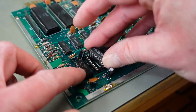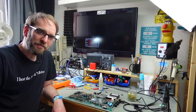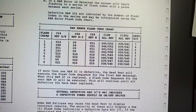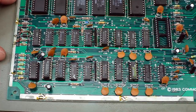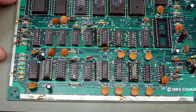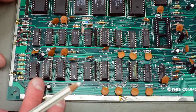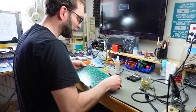I'm putting in a known good RAM chip - Texas Instruments. That definitely changed the behavior of the dead test - we now get four flashes, which means U23. I'll replace U23. As I said, I might as well replace all these RAM chips, but the dead test is a good way to do it - if your multiplexers are working correctly, you get a pretty clear indication of which RAM chip is at fault, going through them one by one. You always have to retest and then it tells you the next broken one. I'm always marking the chip to desolder from the back side of the board.